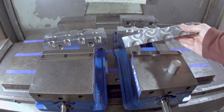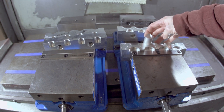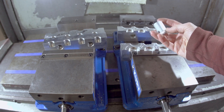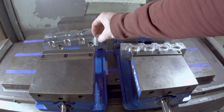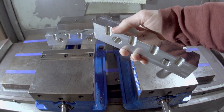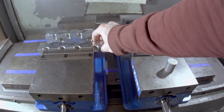These ones on the right side are for the first operation, so the pockets are shallower. The stock gets clamped in there and features get machined into it. But then when that's done, you've got the bottom side that hasn't been machined, so you've got to flip it over and put it over here on this side. These jaws over here are the second operation jaws. The 15 millimeter collar fits down inside there and you machine the top side — the flange side of the collar — do the engraving, and then that's it for the second operation.